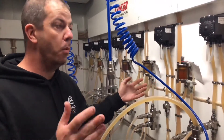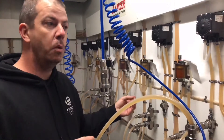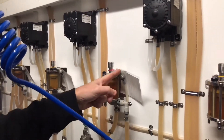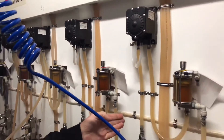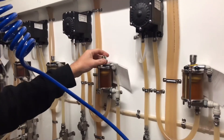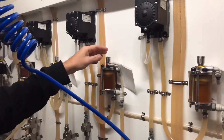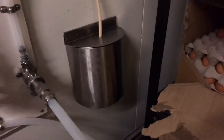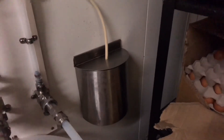Now we just discussed the fobs. One thing we need to remember with these fobs in here — some of the buttons stick. So what that means is you're pushing the fob down here, pumping beer from the keg into the fob, and it's actually letting it overflow and any foam overflow out that line there until the fob's actually full of beer. When you let it go, the fob lifts and it stops pumping beer out. But every now and then the buttons stick. So you're going to walk out of the cold room happy as Larry that you just changed that keg, but this button's down, it's just pumping beer out, pumping beer out — and you're going to overflow the overflow container and dump a whole keg onto the floor, flowing out the cold room. Essentially what you're looking at there is $1,000 revenue for the bar just flowed down the drain.